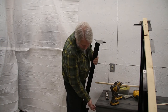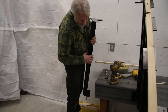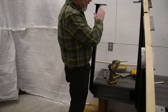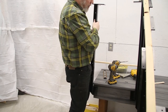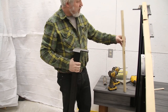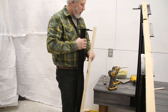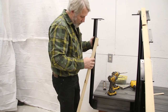We've got the overhang of the deck and a little bit of overhang on this fascia board, so we need to cut both of those back. When we set this post, it needs to be at the same plane as the other post. An easy way to do that is to cut a stick that just fits underneath that mounting flange right there, so you can make sure this post is at the exact same height.